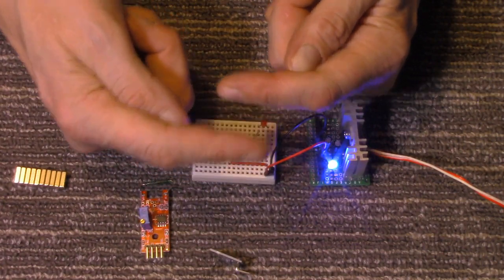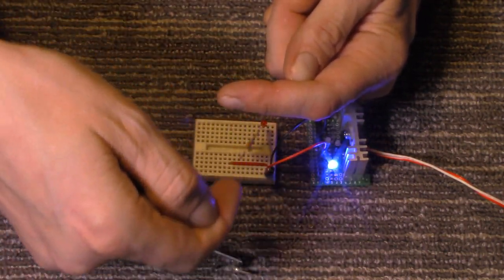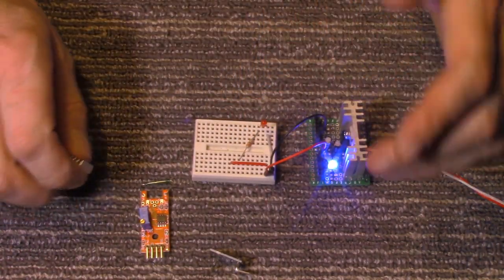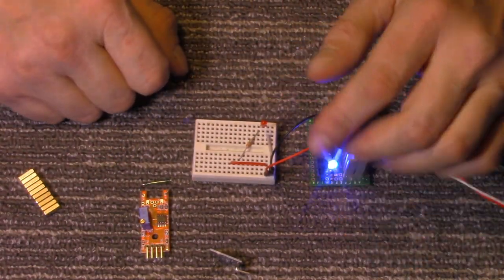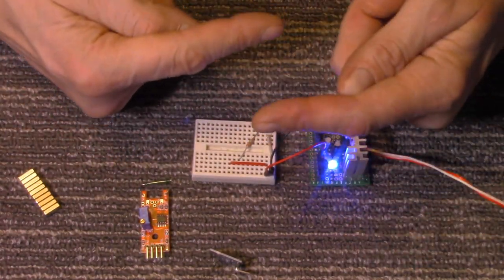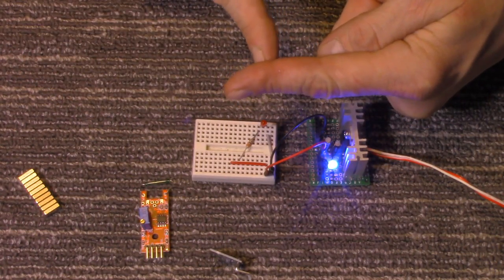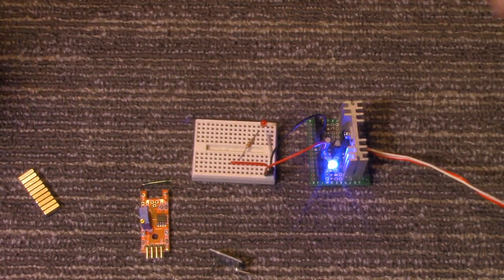And the way that they go, with the magnetic field, you're better off from the front or the bottom of it, not to the sides. Typically, they trigger a little better if it's straight onto the top or the bottom. And that's just where the reeds close. So if they're closing like this, this would be the top or the bottom. And this would be the sides. So, all right.